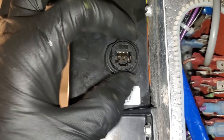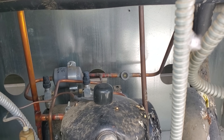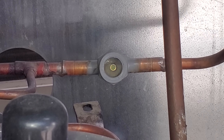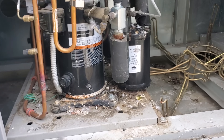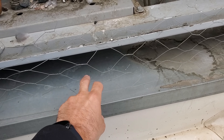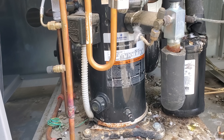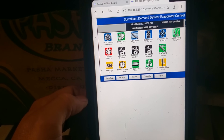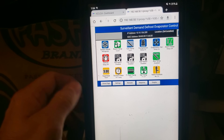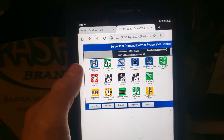This is my Ethernet port that I plug into. I'll plug the Wi-Fi service tool into that and then be able to access everything from my tablet. I came up on the roof and the sight glass is flashing — I'll zoom in for you. It's not bad, but it's definitely flashing, and this rack is full of pigeon crap. We put chicken wire around it a while ago, but these damn pigeons keep getting underneath it. We're going to have to get some gas in this thing too. Oil level looks good though. I've got it pulled up on my tablet — it's just connecting to the Wi-Fi service tool. Box temp is 10 degrees — it's already getting cold in there. That's quick.